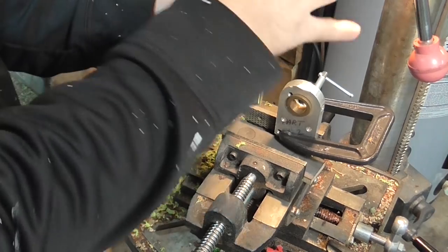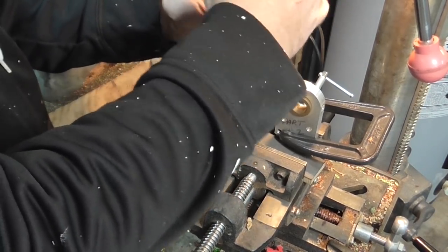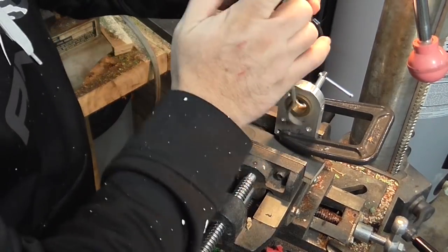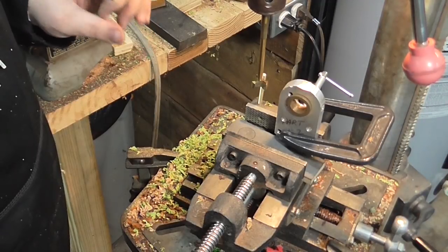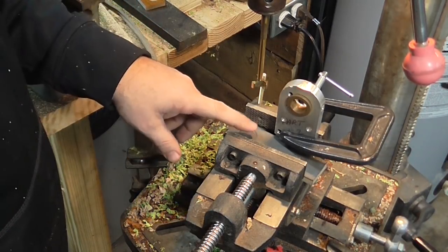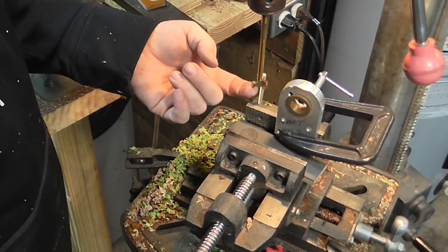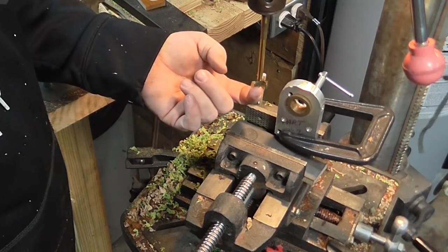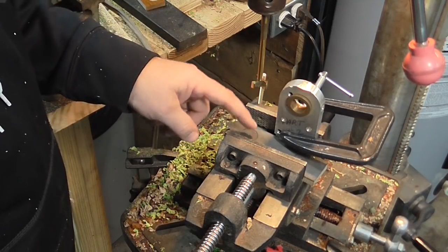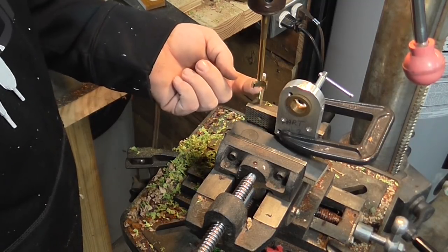This is going to be the same 3/4 inch multi-purpose or multi-angle drill bit that I was using on the lathe, which is probably the reason it was building up so much heat and blew that laminated piece into several different pieces. All I'm going to do now is drill a 3/4 inch hole. I use this bit because it kind of has a pilot point down here, and then these outside edges will cut through the material and will just leave you the little circle stuck to the bit.